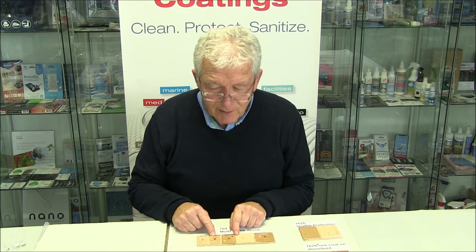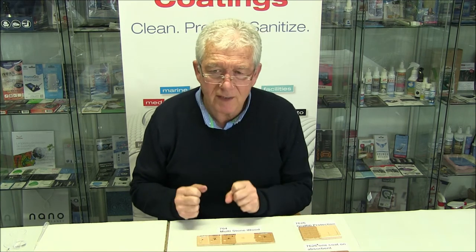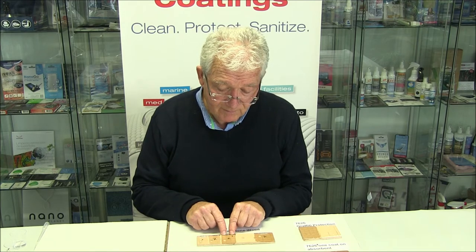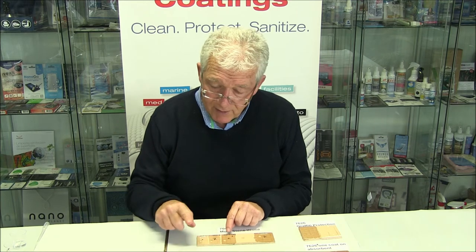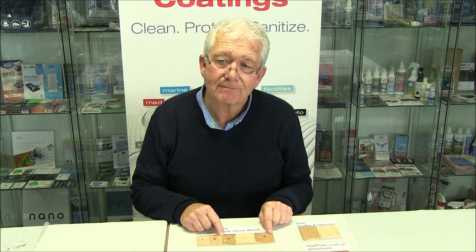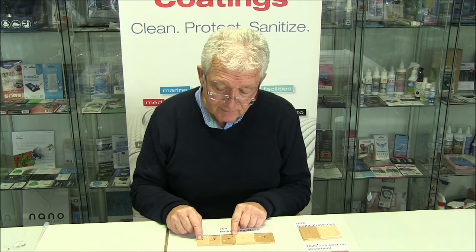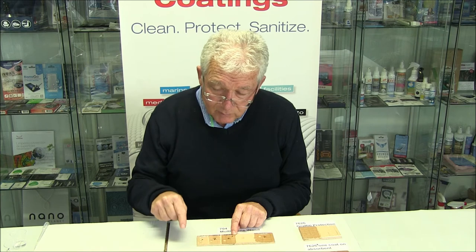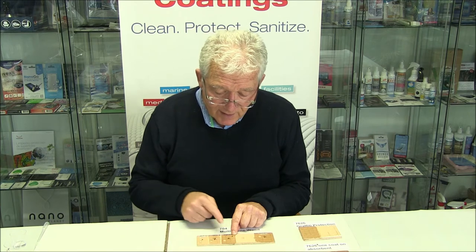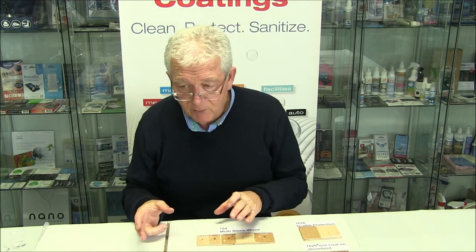They go, but really I also want some graffiti protection and I want even more stain protection. You say then, well, you have two options. You either go for 50% primer and slightly glossy, or you go with a full glossy layer. I would choose this one here. Because with the thinner coating, you're allowing it to penetrate quite deep into the stone because it's diluted, and then you're finishing off with the top, you bond the two together, and you've got the best of both worlds.